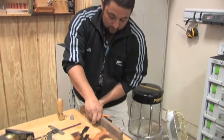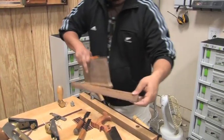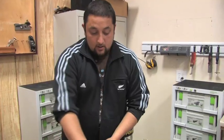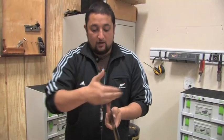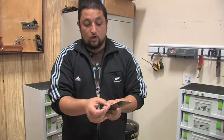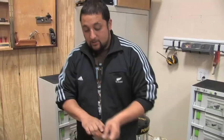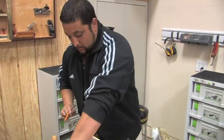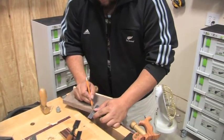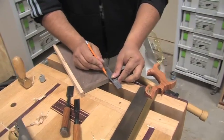Let's check this board out. Could you describe for anyone who might not know what 'set' is? The set is the teeth of the saw — when they file these saws, the set is the kerf. It's basically the distance of the kerf of the saw. Sometimes when you get a brand new saw, you track it — just like a band saw, you draw some lines on a board. It probably works better on the end grain, actually, if you do it with a dovetail saw.